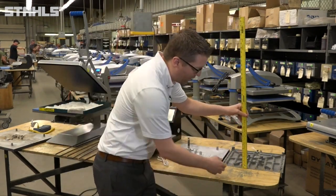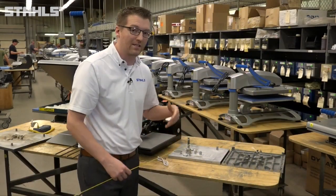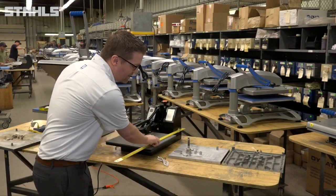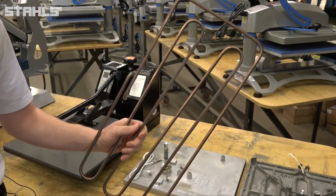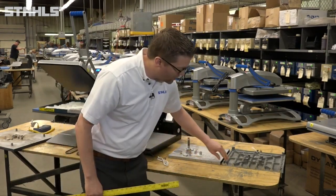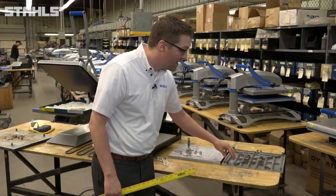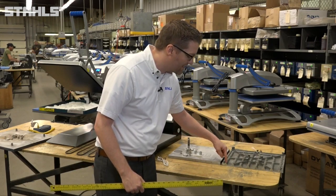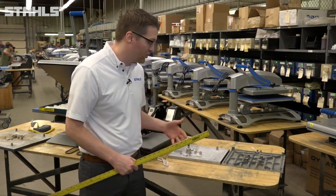When we look at the import press, it's pretty thin. We're only talking about a 1/4 inch thick, which is going to create problems when you're heat pressing a lot of shirts, shirt after shirt. When we look at the actual element itself, on the Hotronix, you have the element spaced and it's cast in here, so it's tough to see, but it's every 1.5 inches apart. So this is the actual piece that goes inside of the element for whatever size that it is. They're 1.5 inches apart, which gives you even heat on all areas of the top platen. Here, this one's actually not bad. They're spaced 2 inches apart, so not as good as the Hotronix, but often on these inexpensive import presses, this is where you compromise on not only the thickness with how it retains heat, but you'll often see these elements in a Z pattern or extra distance apart, creating cold spots on the machine, creating further issues with application.